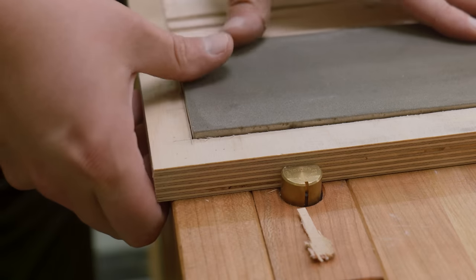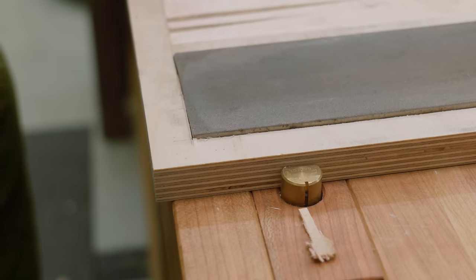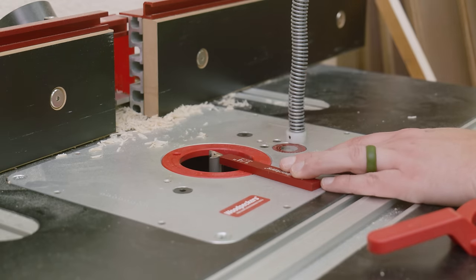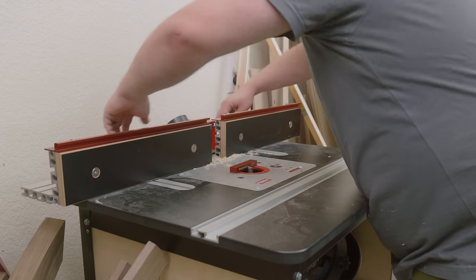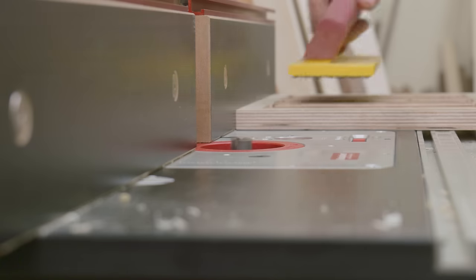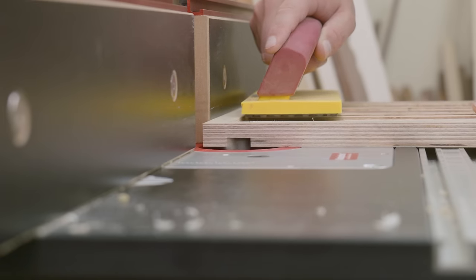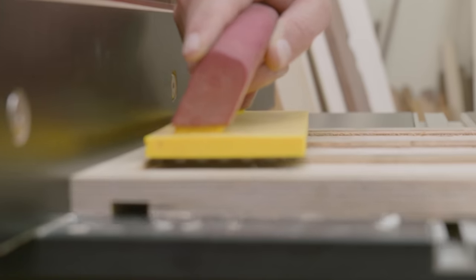With those last rounded corners cleaned up, I could pop in my plate. Once I had a nice snug fit on all my plates, I headed over to the router table to set up my bit and cut in a groove. As we've talked about many times on the channel, 3/4-inch plywood is not 3/4 of an inch — so this bit is specifically designed for 23/32nds or 18mm thick plywood. If you guys have been looking for plywood bits, I'll leave a link in the description — it comes in a combo pack of a quarter inch, half inch, and three-quarter inch, so three birds, one stone.